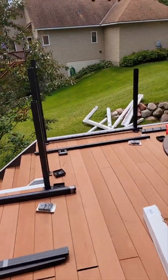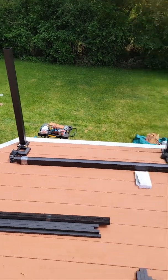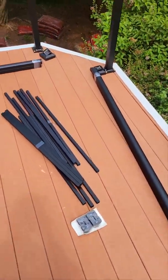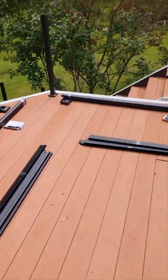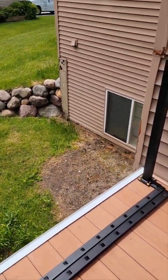Right now, you can see that I have everything lined up. The way I like to do it is I line up all of my rail sections, the balusters, all of those fun things, the parts, the components, the screws, the brackets. You're going to need obviously a number 2 square bit. I like a, what do we have here, 5/64 drill bit, that's perfect.